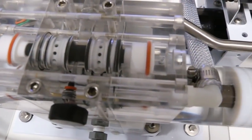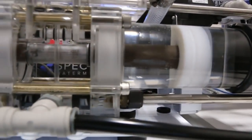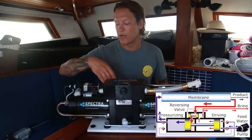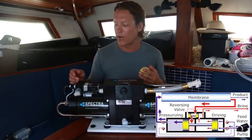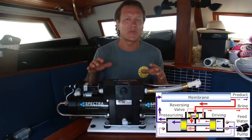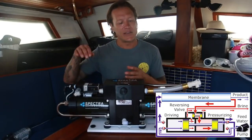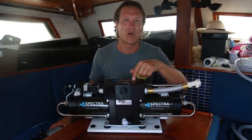So it can be run by just water. There's a diversion valve up here — when the piston reaches the end, the diversion valve shifts and diverts the water to the other side, pushing it the other direction. The inlet water comes in, goes through the intensifier pump, and comes out the bottom. From there it goes into the membrane, and about 10 percent of that water turns into product water or fresh water. The really cool thing is the power recovery system — instead of just discharging that 90 percent wastewater already pressurized to 700 PSI, it diverts a lot of it back into the system to minimize how hard the feed pump needs to work.